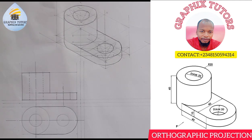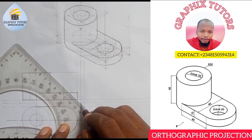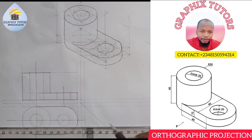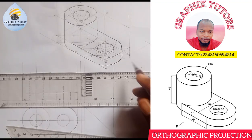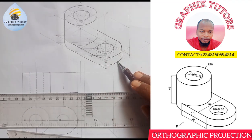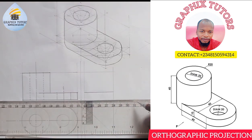We will now draw the end view. At this junction, you draw your 45-degree line and project each and every part. I'll bring this out and tie it up. I'll bring this through — meaning you're looking at it from here. That's the end view where you see the thickness, which is the thickness here, seen as a straight line. You see the thickness too, and also the height.